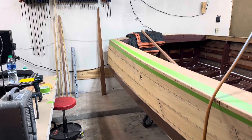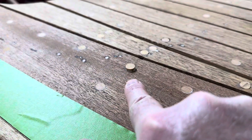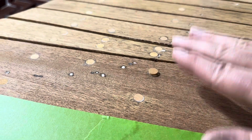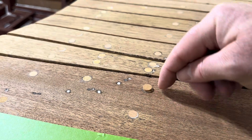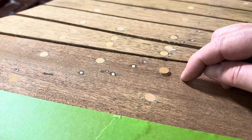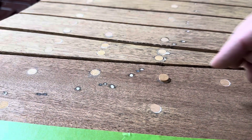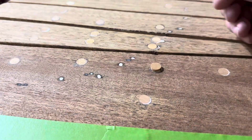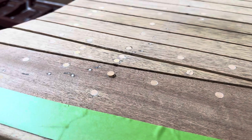There's some wood back there. And here is an example — I just put this mahogany plug in today. There were a couple of locations when I was attaching the top planks where I would go to drill for a wood screw hole and then hit another wood screw underneath, so it didn't go all the way in. Rather than re-drilling it, since there are plenty of wood screws, I just left it. Tonight I went ahead and did the countersink and installed these mahogany plugs — there's no wood screw underneath. That happened maybe six, eight times total.